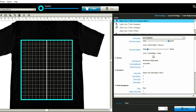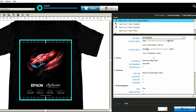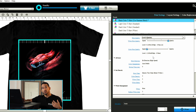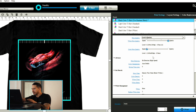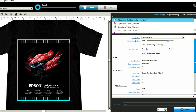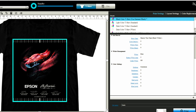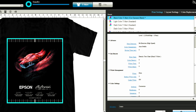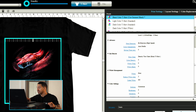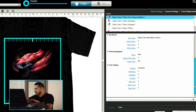We'll go ahead and lay down the white color layer here. The reason we prefer white is it gives us that white base, and additionally if there is any white in the design it'll also add that in as a highlight layer to really make those designs pop. You will also have additional options such as saturation, brightness, and contrast controls. Ideally your artwork is already prepped and ready for printing and you're just dragging and dropping, but if you do have preferences to increase any blue levels, reds, or make any television-style adjustments, those will all be right here in the software.